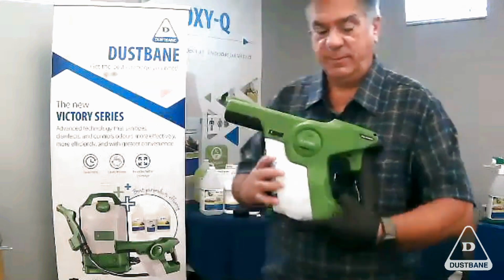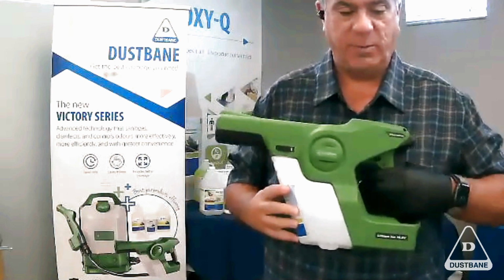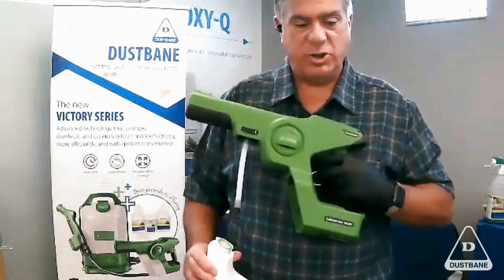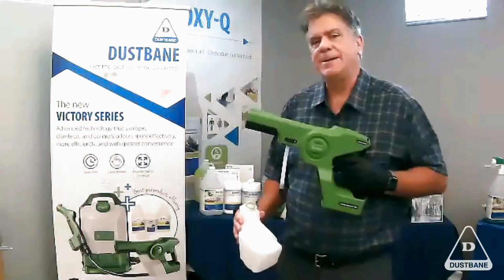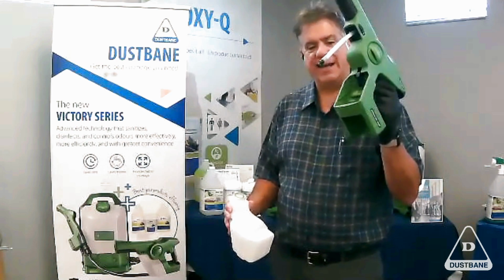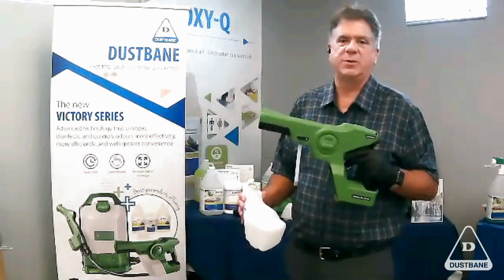The trigger. We want to remove our tank. We want to turn the dial, right, on off. We're going to pull the trigger, and the tank releases. Another important point: it's got to be pulled gently. I've seen some that people have pulled out, about 5-6 units out of many thousand sold. Sometimes it has to do with the mechanism inside. So what we've done is replace the whole module, but there will be a service kit in the future for people that rip them out.